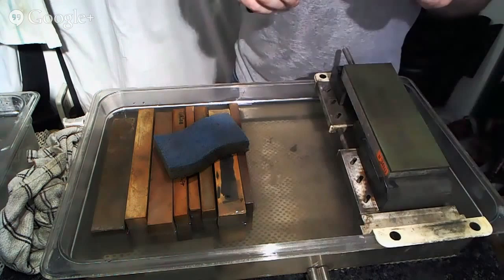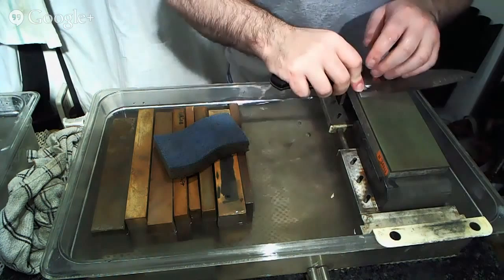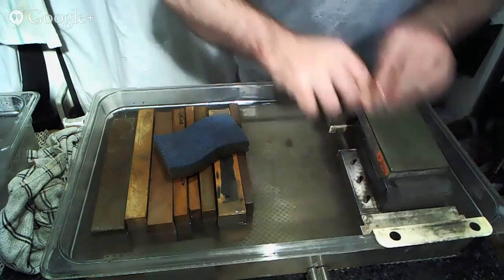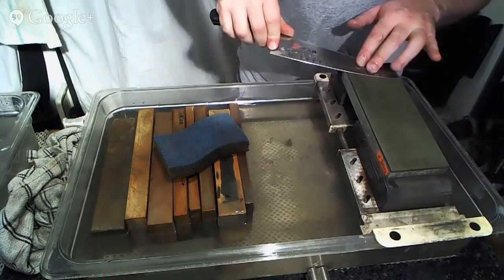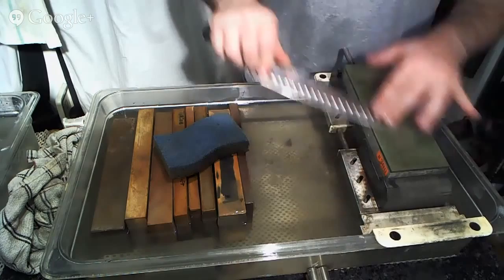On the other side, I actually do a slightly different technique, which I will show you right now. Here, again, we can't start off in the same angle approach, so we start off perpendicular and coming through. Transition back out into that 45 degree angle approach, and as I come up towards the curve, I'm going to start to make small incremental adjustments as I move back and forth. Back and forth, tiny adjustment, all the way lifting up and rotating back until I get all the way up to the tip and then coming back down.